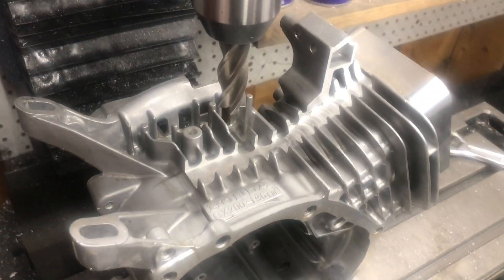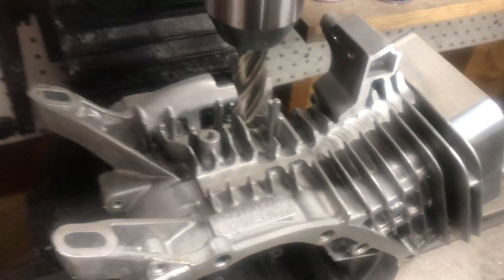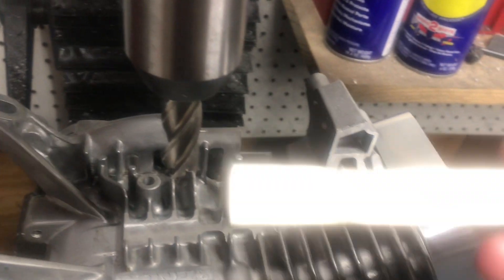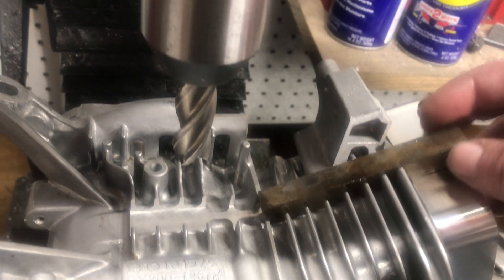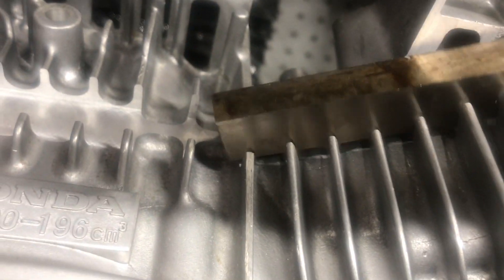The way I'm doing the spines now — I figured I'd show this since I haven't showed it in a while — we're actually grooving through everything, and that leaves a really clean look. It's just a piece of tool steel, basically a boring bar. You can see how this is going to leave a really clean finish and it all fits in nicely. This is a smaller piece than what's actually going in there — I think almost three quarter, maybe five eighths. Five eighths is a big, thick piece — none of that quarter inch stuff.